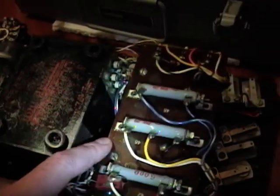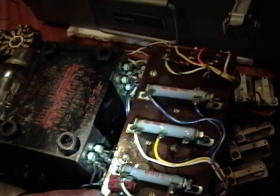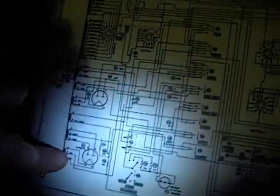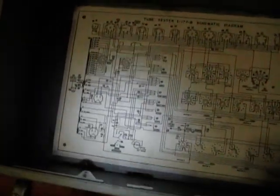Here's the tester itself, which is also coated. You can clearly see on the transformer and boards it's all covered with some kind of greenish goo that would prevent humidity and fungus from getting into the boards and components. Here are the two tubes — the 83 rectifier and a 5Y3. Actually looking more closely, it's an 80, an 83, and a 5Y3.